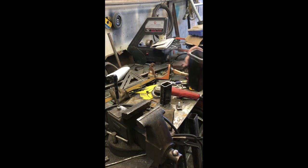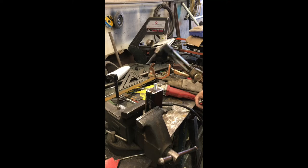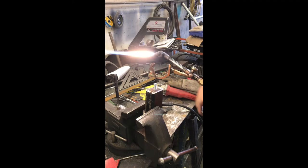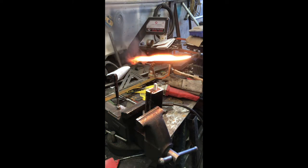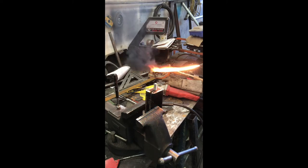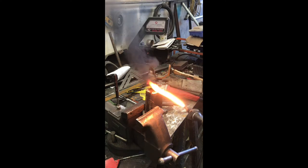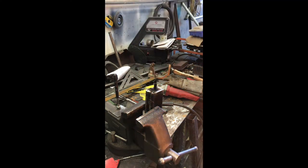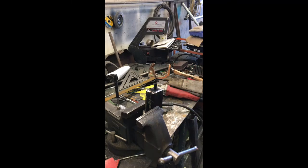All right, gotta build another one. So instead of walking over to the bolt bin, getting a couple more nuts that I can throw in here for thread protection, I'm gonna show you guys another way to save the threads. This is an old pipeliner trick. Turn your acetylene way down till you got a heavy soot. And smoke the threads. That soot will keep any spatter from sticking anywhere on there. Quick and easy trick for you guys.